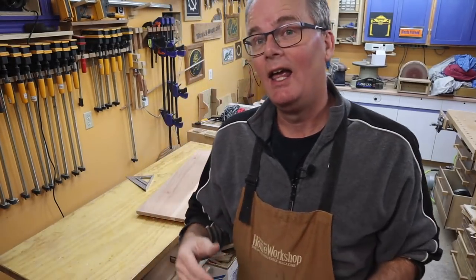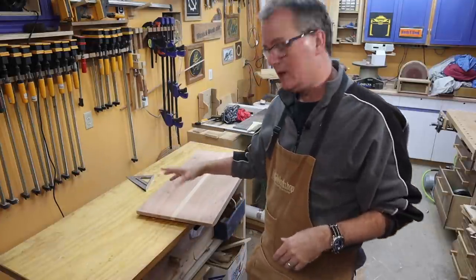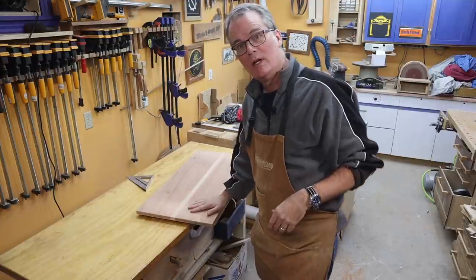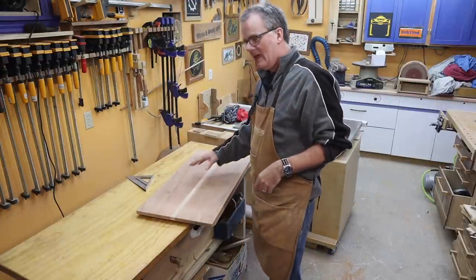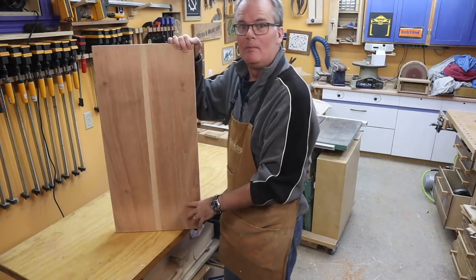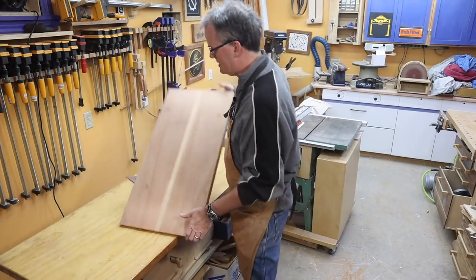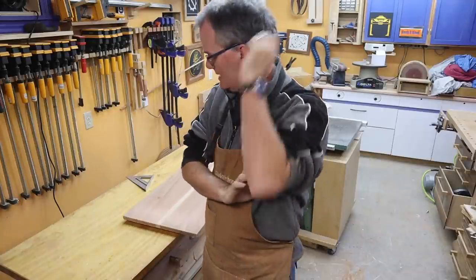So I've done a lot of sanding and a lot of thinking. I started at 80 grit but very quickly went to 40 because I wanted to bring this original surface right back to bare wood. The longer I sanded, the more frustrated I was getting, because there's still a significant color difference. I sanded and sanded, then set it aside, and it's been most of a day as I've been pondering a couple of ideas.